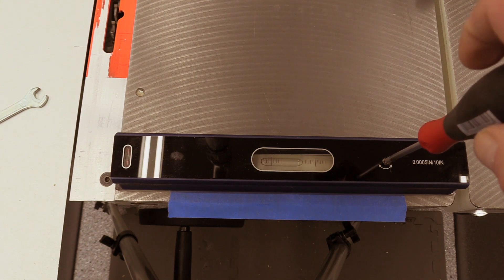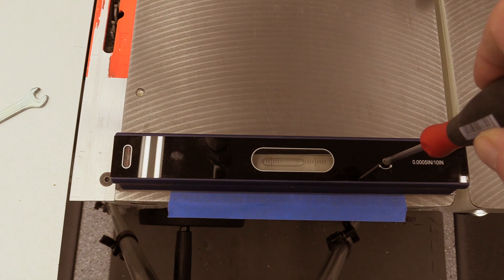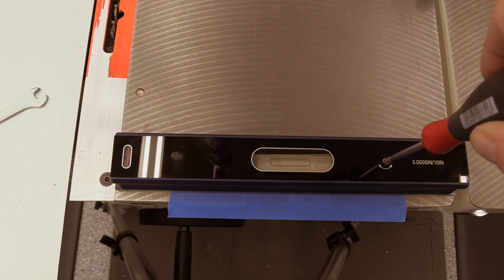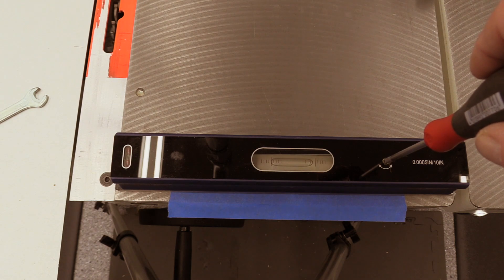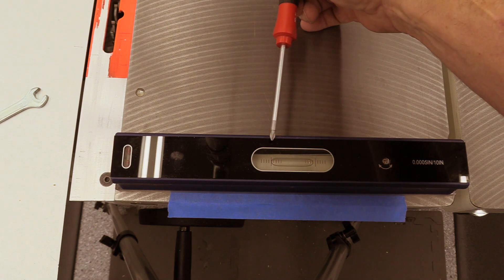When I initially set up the slider I spent several days and never got it close, not really understanding what the problems were. The adjustable level let me really hone in on making sure that there was no twist in the cast table and then getting the slider itself set up great.